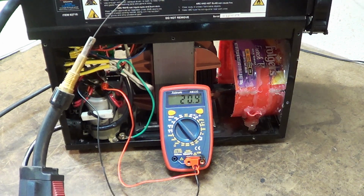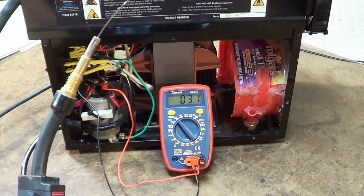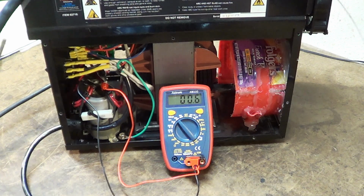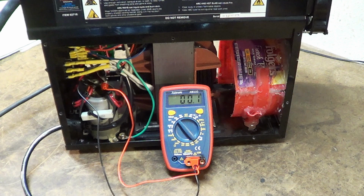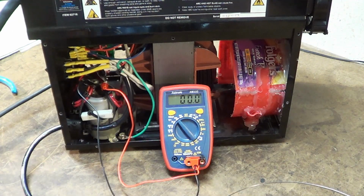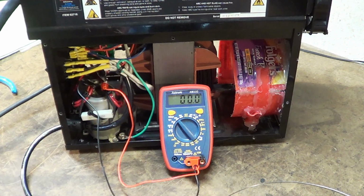36 volts. Now, see it discharging. That is that bleed resistor taking it to zero. Now, that took 5 or 7 seconds, or 8, 9 seconds to come all the way down. We're not really worried about getting all the way down. What we're trying to do is just to get it down low enough that the arc isn't terrifying. So that's the basic premise.